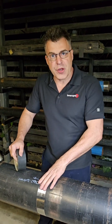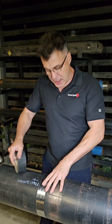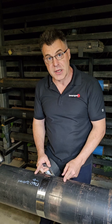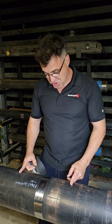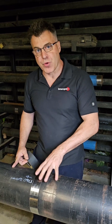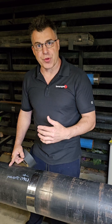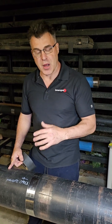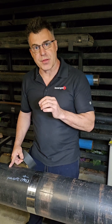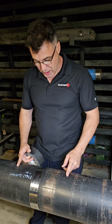We can save that one — mark it as an 8-inch nominal bore pipe and stick it back in our toolbox. So once we've got our FECO strip on, this pipe is very clean and good and should give us a really good scan. We should only get a dead zone of about 50 to 100 millimetres either side on a medium range, and on a long range maybe 200 to 300 mil. But if the pipe is quite heavily corroded with pitted corrosion and we still have air bubbles underneath after prep, that can reverberate or cause noise and our dead zone will be quite large.